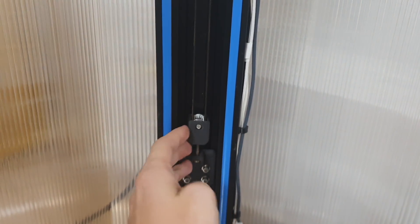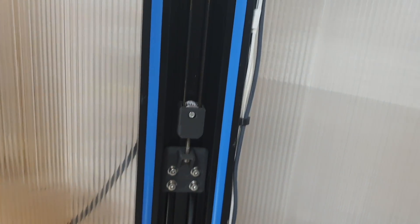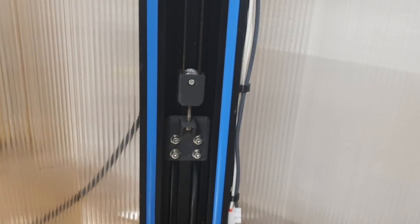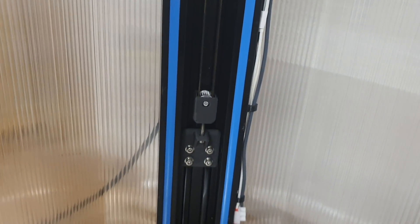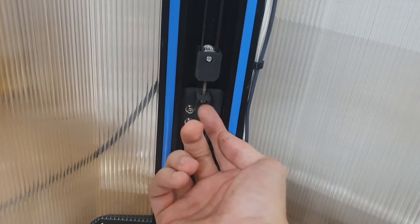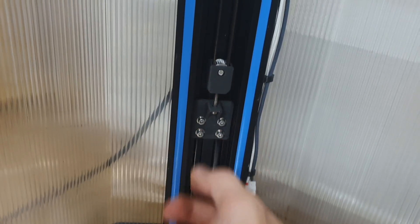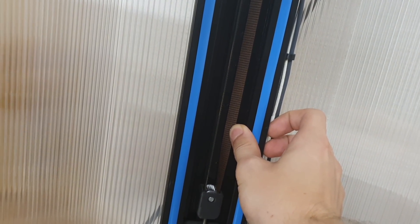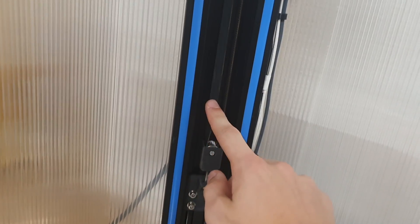Next, I want to put some focus on these belt tensioners because I'm quite proud of them — again, my own design. I couldn't find any for the Tevo Little Monster, and the existing design was horrible: there was an aluminum plate on top to which the roller was attached and you had to force it down with your thumb. With mine, you first screw down the base plate, then a screw goes up into a nut in there, and you can just tighten the whole assembly by tightening the screw for a nicely tensioned belt. Those are 9mm Gates belts — probably a little overkill, but I'd rather have overkill than floppy belts.